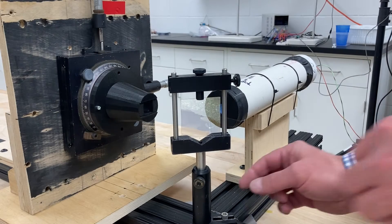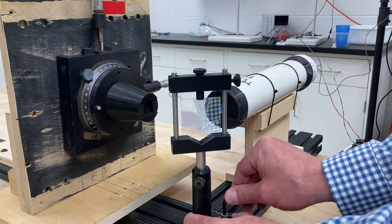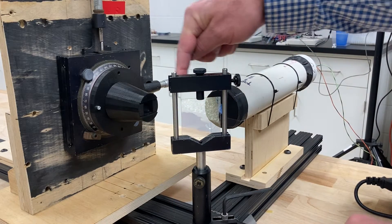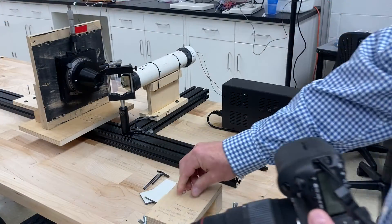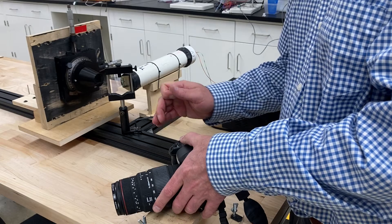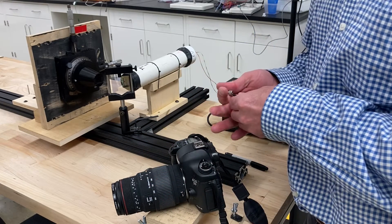We want to make sure we've got that fully covered so that we can see all the light hitting the mirror. So here we are back at the beam splitter, and what I'm going to do is bolt down the beam splitter so that it's not going to move anywhere. I tighten this down, and we know that this light path comes through here, and then it's going to go through the place where the Wollaston prism is going to be in a minute or two. For the initial alignment of this, I have a mount made for a Canon 5D camera, which is just one of the lab cameras.